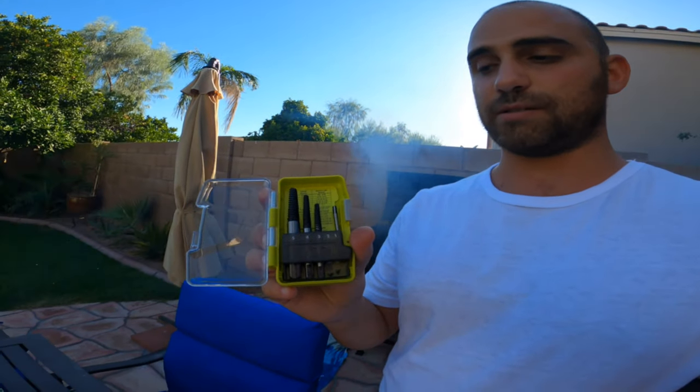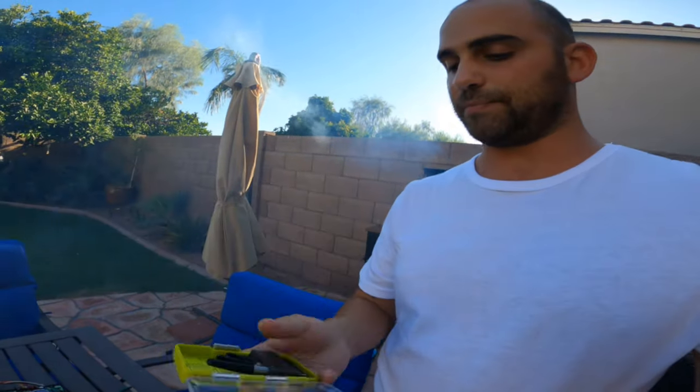During the time I was taking off the bottom plate there were some screws that were stripped, so I had to use these easy outs. Amazing — came right out. Purchase yourself some if you need them, and if you run into that issue, now you know what the fix is.